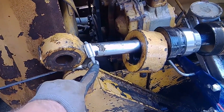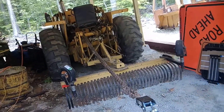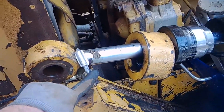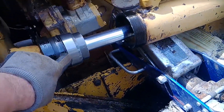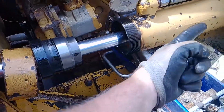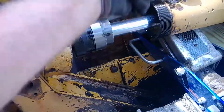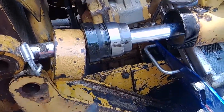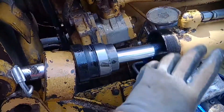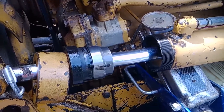My come-along is attached to a fixed point — another tractor over there with a chain on it — and you just nice and gingerly pull and pop this apart. Here are the seals on the front; there are going to be some on the back too. As we continue pulling out, we're going to raise this up a little bit so we don't scar up or do any damage to anything, because everything looks good and shiny and smooth and true. We just have to change seals.